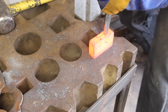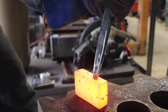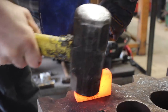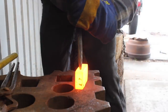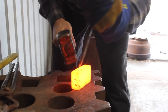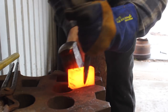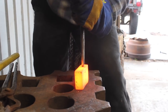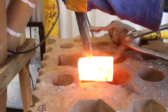I'm turning the billet around each time, so that any sideways alignment of the punch is mitigated by turning it back and forth like that, thereby keeping it centered, at least theoretically. At this point I started punching from the other side of the billet after I'd gotten about halfway through, as it started to drift off center a little bit. Punching from the other side is one of the quickest ways to mitigate that.